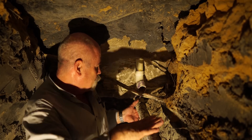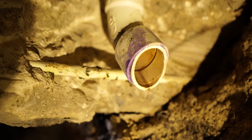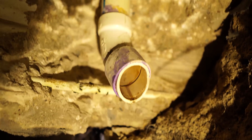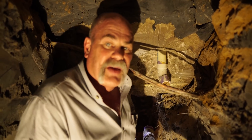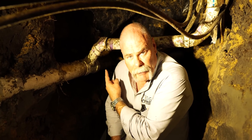It looks like it broke here, here, and on the other end right under the kitchen sink — so all this raw sewage has been going under this house for who knows how long. If the pipe pushes down it's going to cause a break, and that's exactly what happened. We had to chip out a little concrete to get up in here. We're going to cut the pipe and put on a new 45 or long sweep 90 to get things lined up properly. If you're a plumber, when you're doing rough-ins make sure you have a continuous solid steady bed under your pipe, coming up just over halfway, packed in tight.